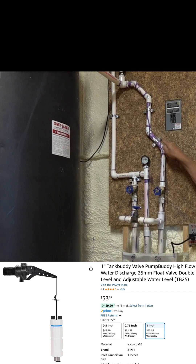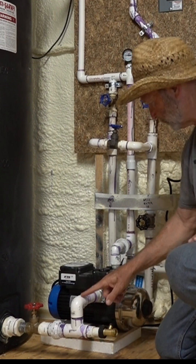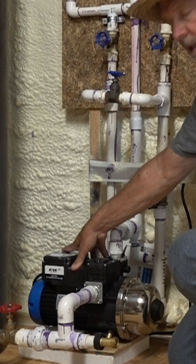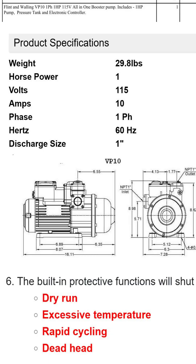The water from right here starts filling that tank again. Now the way the pump works is water comes in through this valve — this is the suction side. This is a drain. It comes in here. This has a cut-on, cut-off switch. It cuts on around 30 PSI and cuts off around 60 PSI.